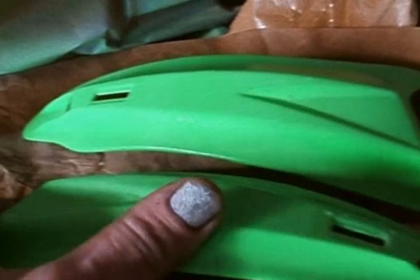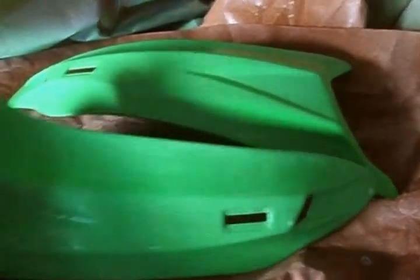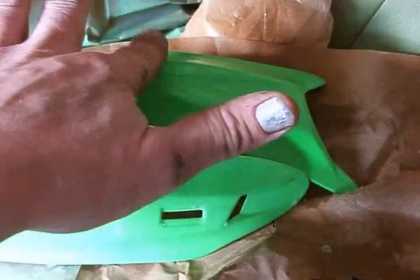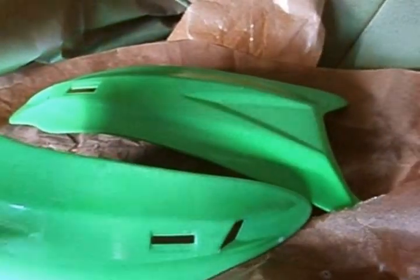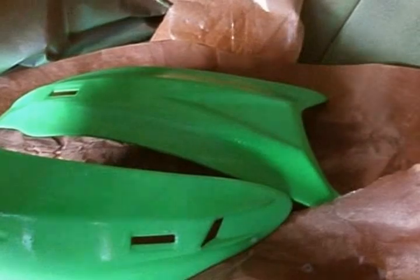The one in the foreground is now completely sanded and smooth. One important thing when sanding: you'll actually feel it change — going from rough texture you'll feel under your paper, but when it gets smooth the paper feels more sucked towards the work because it's so flat. Any remaining high spots you'll feel under your fingertips, so just work on those bits. You can feel when it's done as you're doing the work.